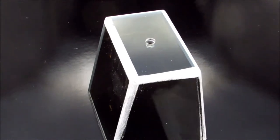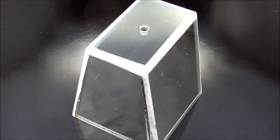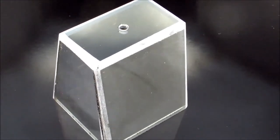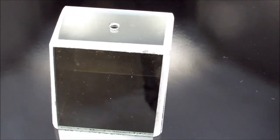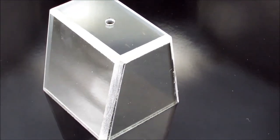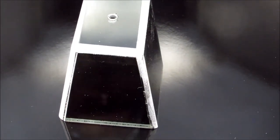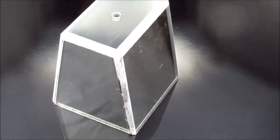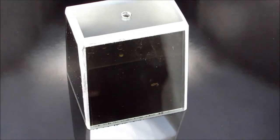I've roughed my bullnose edges, and I didn't do all the shaping that's going to be done. I actually want to do most of the shaping on the next wheel. It's a little smoother. Sometimes this rough wheel leaves big marks. It's real hard to get rid of. So I like to do my final shaping with a smoother disc. So anyway, that's what we're going to do next.